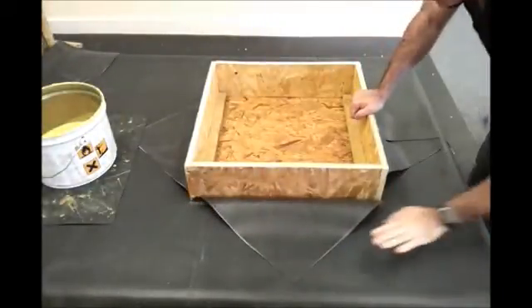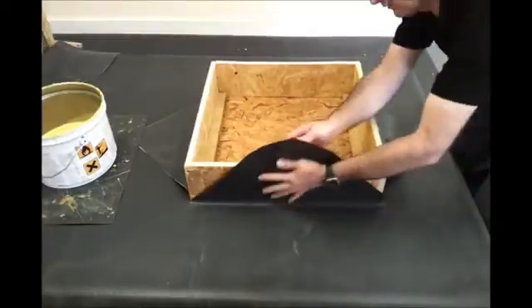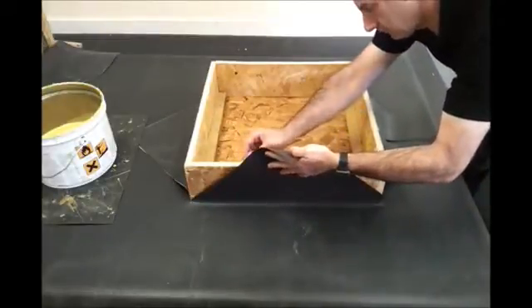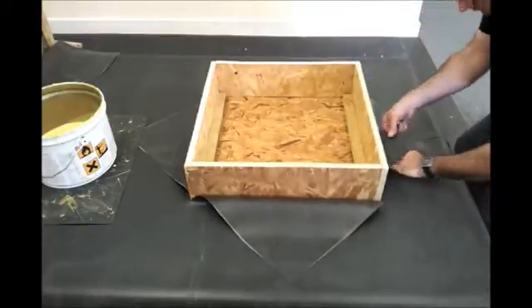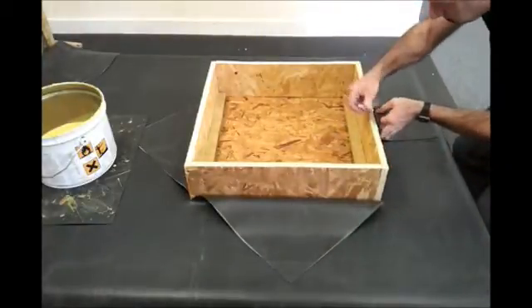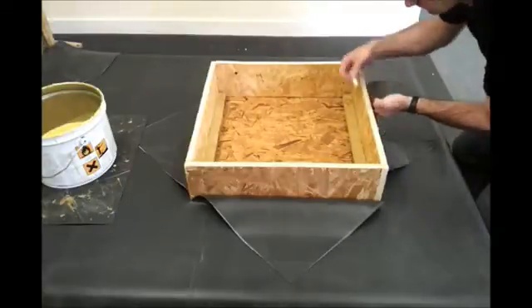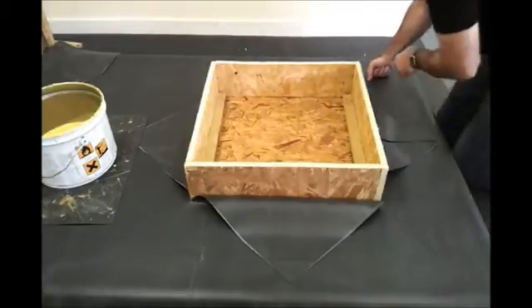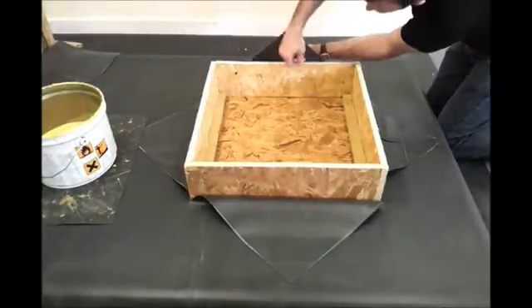In this one we're going to bond the sides of the skylight upstands together. The EPDM sheet membrane is going to be attached with the yellow bonding adhesive. The contractor is making some marks at the top of the EPDM sheet to indicate he doesn't need to go beyond those lines — anything protruding higher than the height of the skylight is excess membrane and we don't need it.